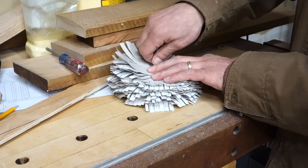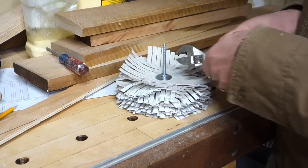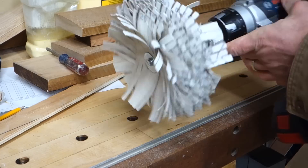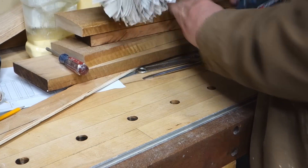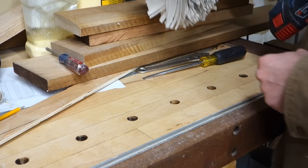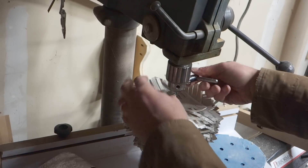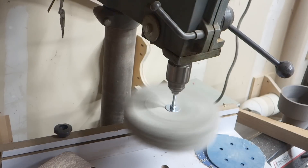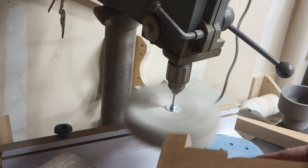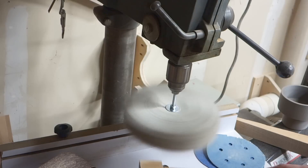That's all well and good, but it doesn't need to be this thick — you don't have to destroy a whole bunch of blades if you don't make it as big as this one. Chuck it up and you're ready to go. I used a quarter-inch 20 bolt for this one; three-eighths works well as well, half inch — any of those work, whatever will fit in your drill or drill press. I use it in the drill press far more than a hand drill. When you first build it, you want to get a scrap piece of wood and jam it in there to mesh up all the little strips of sandpaper so they're interweaving and pretty messy.